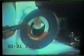When removing the wheel from the store, check it for any damage. To ensure that no loose grits adhere to the side of the wheel, they're removed with a brush. Having done that, we proceed to check it for soundness by tapping it sharply and getting a nice ringing sound. With different sized wheels, you'll receive a different sound. Nevertheless, it would be a true sound each time. A wheel of the same size, damaged and cracked, would produce a sound like this.